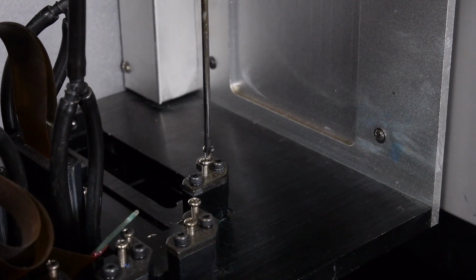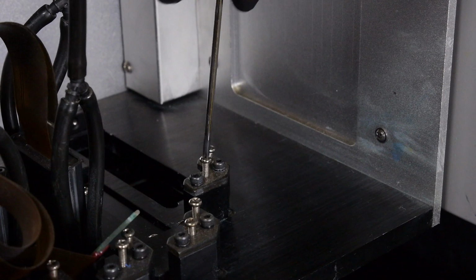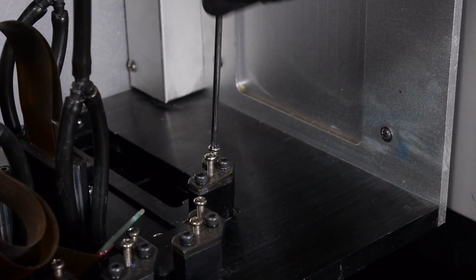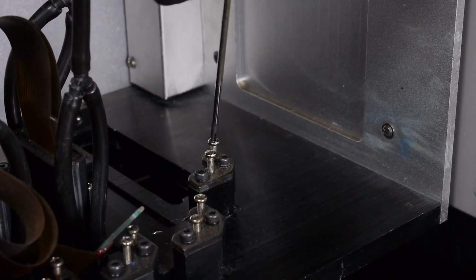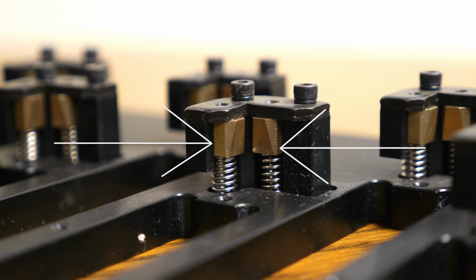Prior to mounting the printhead and mounting bracket into the jet plate, loosen the 2 mechanical adjustment screws to ease the difficulty of inserting the mounting bracket. This will ensure clearance of the adjustment pins, the brass wedges, from the mounting bracket. These brass wedges are what act in unison with the conical pin described earlier to make our adjustments.